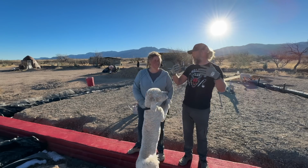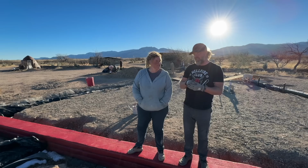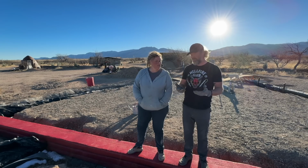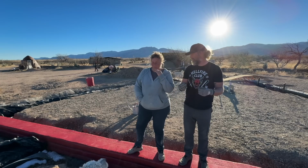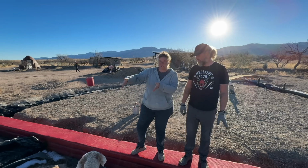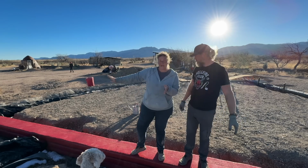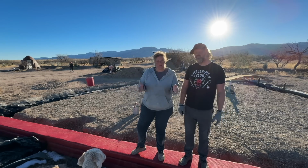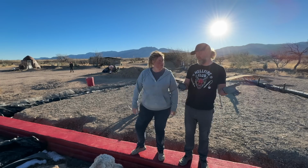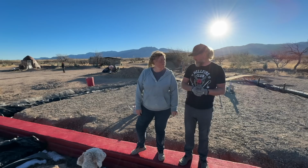It's got 3 circular walls all coming into it. And I would feel a little better if we could work in a way to buttress it and strengthen it a little bit, but also do it in a functional way that makes sense in the bathroom without cutting into that space. My idea is take the shower wall 3 feet off and build your buttress there, and you can use that 18-inch or 16-inch wall as part of your shower wall. That would give some separation from sink and toilet. And we'll be doing the shower all custom, so we can seal it up and make that work. We're not worried about using Earthbag walls, but that's one option.